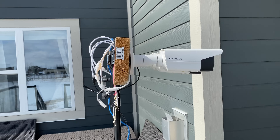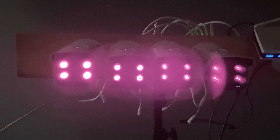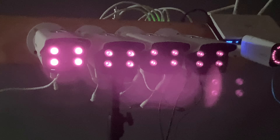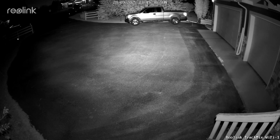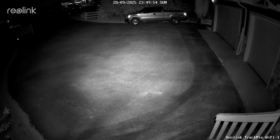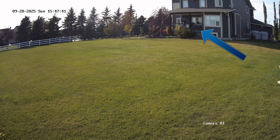One more bonus point on this topic — it's about IR lights. These four cameras all have different zoom levels or lens sizes, and each projects its IR lights at different angles depending on the zoom level. Using another security camera you can see the angle of the IR lights change depending on the zoom level from wide to zoomed in — the brightest lights are concentrated in the center of the shot. This is important because in an attempt to angle the camera to avoid unnecessary zones, you may not have good IR light coverage on the zone you actually want. In this shot I don't want the wasted space of sky and direct sunlight — you can see me on the deck and the direct sunlight is making the rest of the shot dark — so I'll lower the camera for excellent ground coverage, and now we're back to normal brightness.